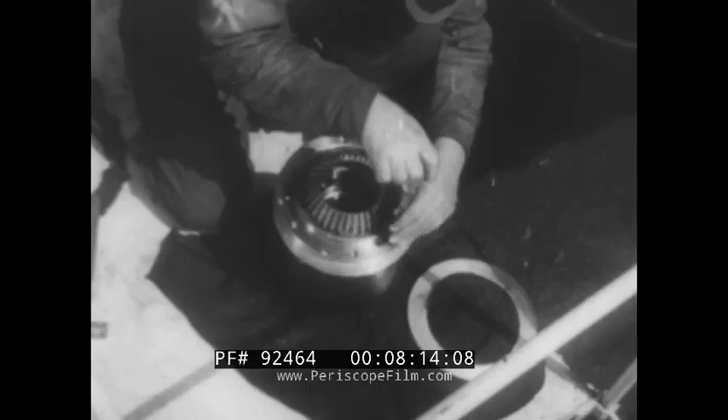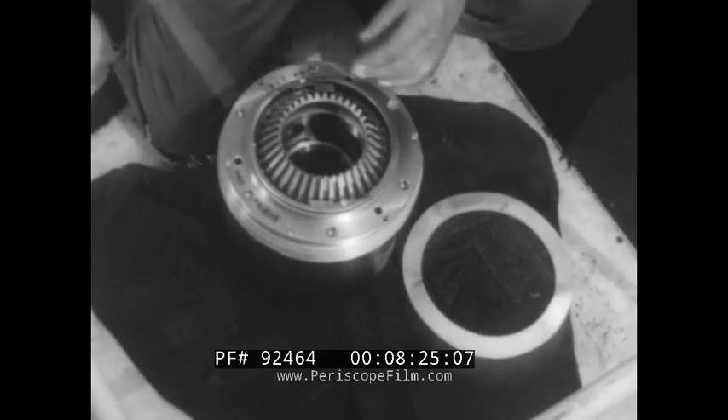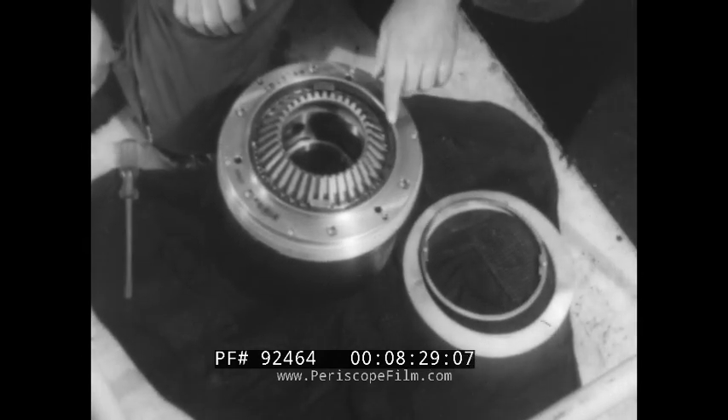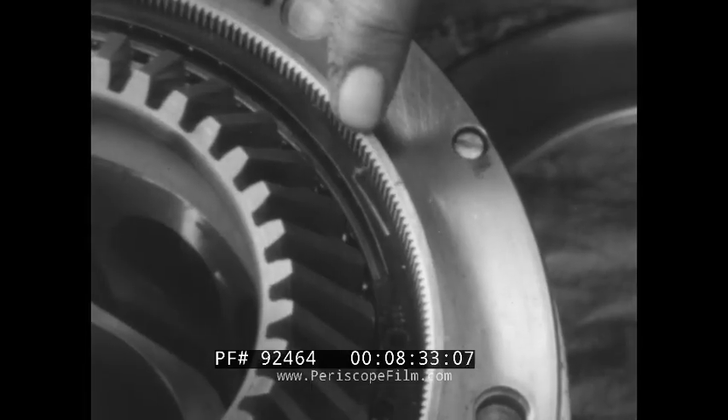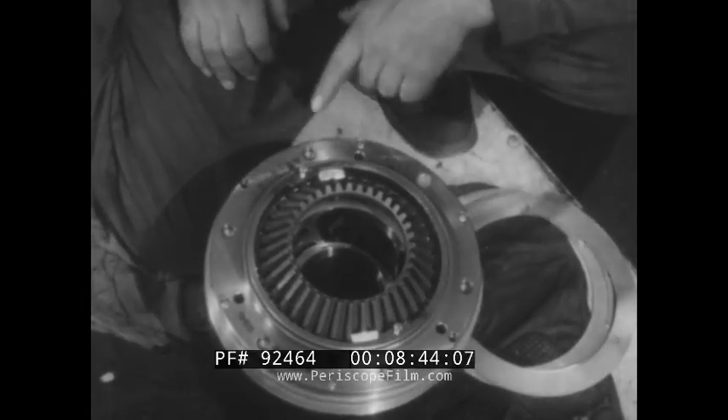That completes the inside job. Now to install the dome. Mel turns all three blades to full feathered position, hard against the stops. Ott brings in the dome for checking before installation. Now, to make sure the two stop rings — which control high and low pitch of the propeller blades — are set at the proper degree markings. I check the lower ring: the proper setting for the blades at low pitch is 20 degrees. The arrow on the lower ring should point exactly at the 20-degree mark on the dome circumference — this one does, so it's okay. The upper ring, controlling the angle of the prop blades at high pitch, should be set for 88 degrees, and I reinstall it that way.